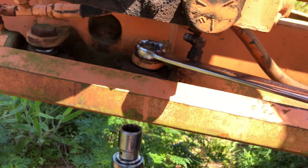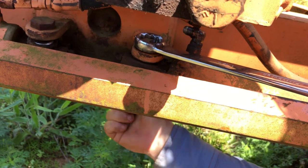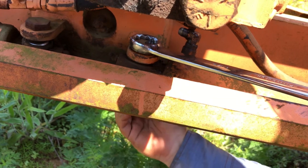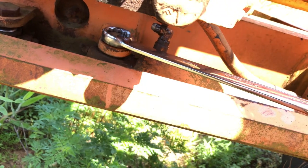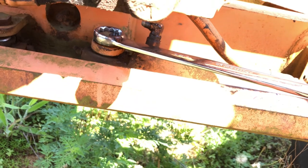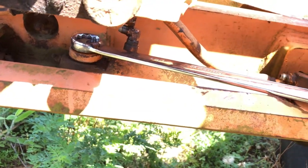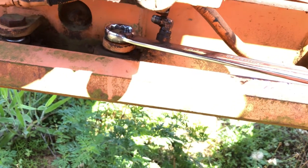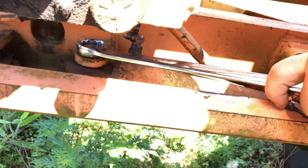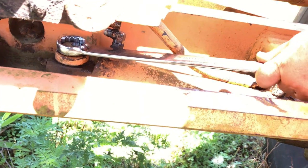And then there's also a company called Crown Products, and they sell O-rings and all the different internal plastic seals and pieces for all these cylinders. Basically you rip the cylinder apart, and then you take it to them with all the parts, and they'll measure and find you every piece you need, and basically make it so you can rebuild this cylinder. So even though the factory is long closed and you can't get parts for these anymore, I don't need parts. I just need the seals and stuff to be able to rebuild.